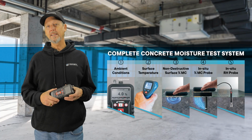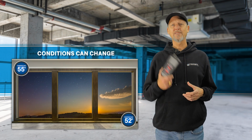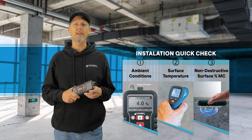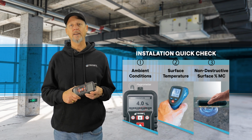When applied, these 5 steps will give a good indication of the overall moisture condition of a concrete slab. Because conditions can change, it's always recommended that you repeat the first 3 steps of this test at the time of installation or application, and this will help to protect against failures.